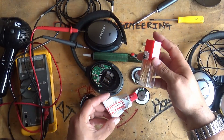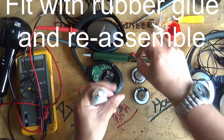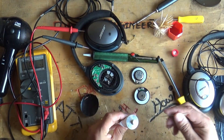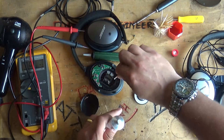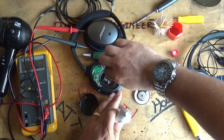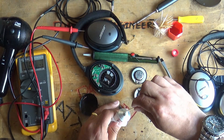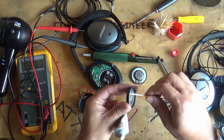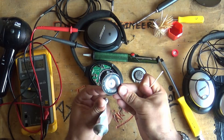I find Copydex is the glue to use to replace those speakers. Use a toothpick to very carefully put a thin layer of that rubberized Copydex glue around the speaker and also around the enclosure, so that those two mating parts bond together properly.